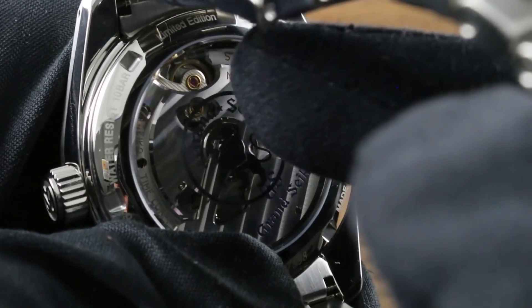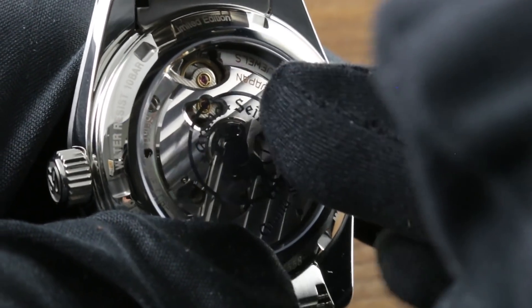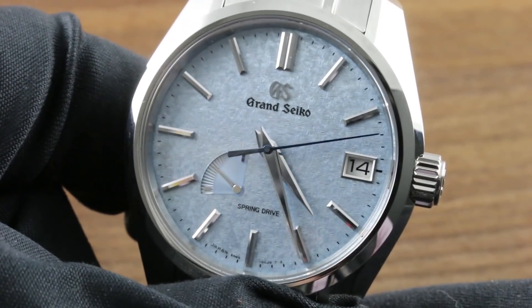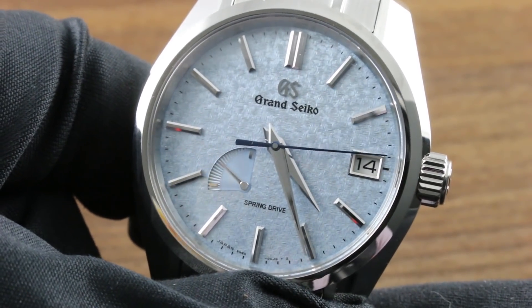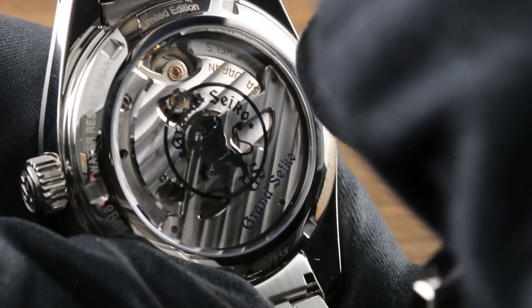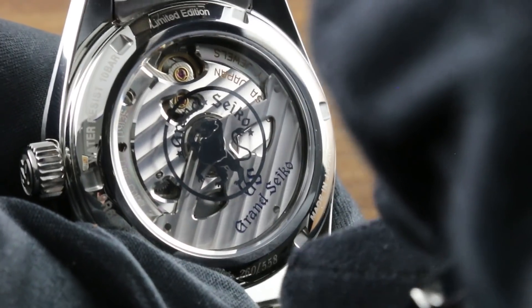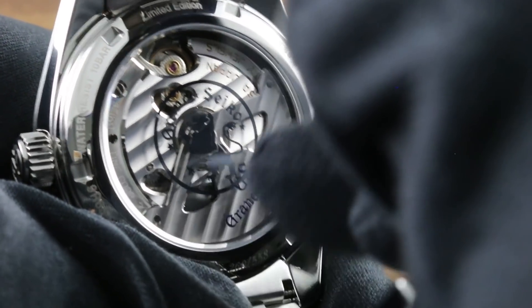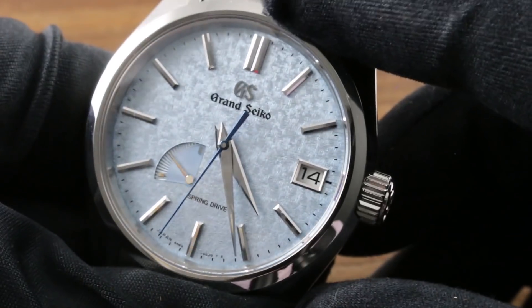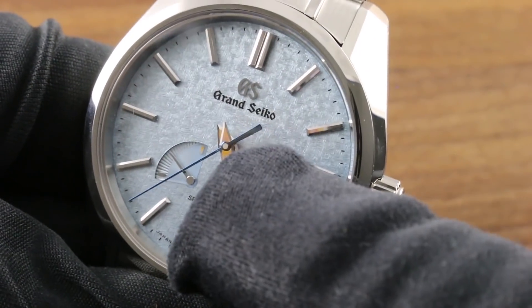Remember, a Swiss mechanical chronometer is minus four to plus six seconds per day. That unidirectional wheel speeds up as the electromagnetic back-force reduces when the watch is running slow, and when it runs too quickly, the electromagnetic force feedback loop increases to slow it down — it automatically governs itself by creating an induced electrical current in conjunction with that quartz oscillator. It is a 30-jewel watchmaker-assembled, watchmaker-regulated, and watchmaker-serviced lifetime movement that also includes stop seconds, a quick-set date, and a power reserve indicator.